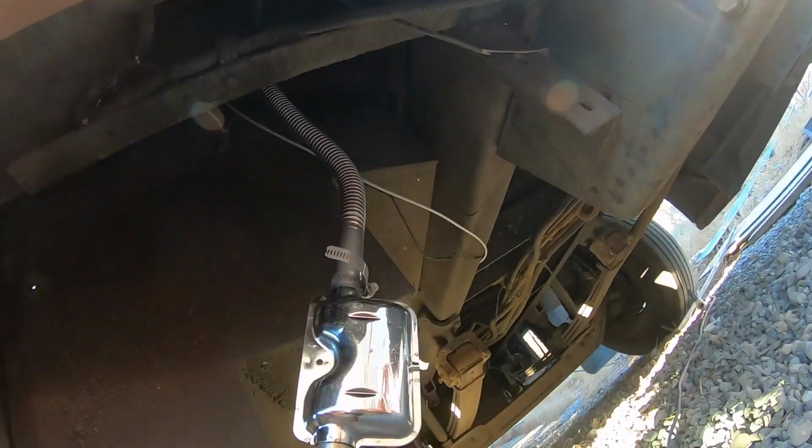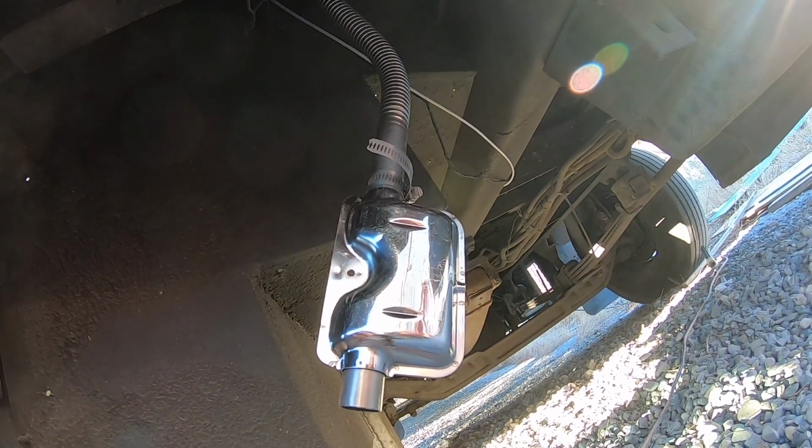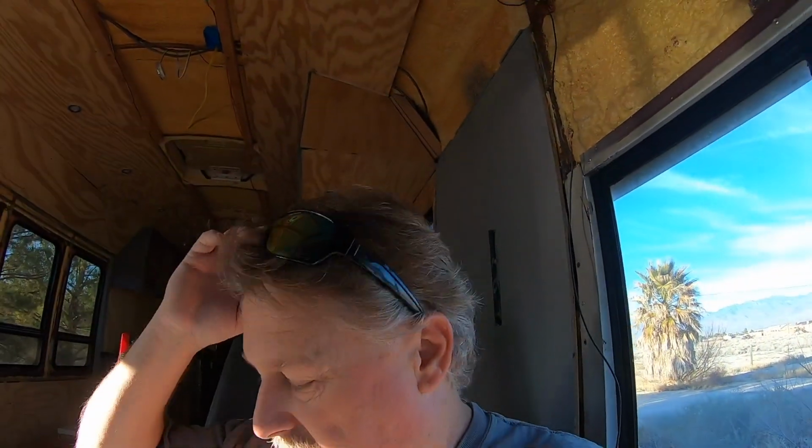It's warm. I don't see any fuel yet. That went out there and got a little bit of hope. Sounded like it was firing up, and I could smell diesel fuel. But like I said, it's probably shutting down again. Yeah, it timed out, so I'm just gonna have to keep cycling this until it fires up, because it's got a bunch of air in the lines.